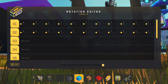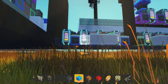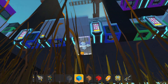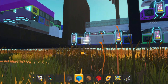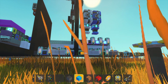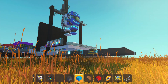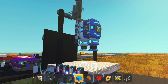I'm able to move it accurately by having each of these controllers be a binary sequence. This is a four-bit binary, meaning we have 16 spaces we can move to including zero. So we have one, two, four, and eight. Depending on which one of these is on, we can move the bed, head, and the vertical motion anywhere between zero and 15, which makes 16 total slots — making this print on a 16 by 16 by 16 square.